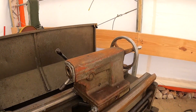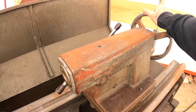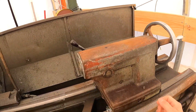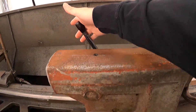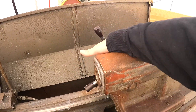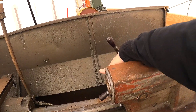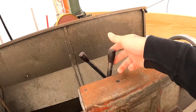One of the things that was wrong with this lathe when I got it is the tailstock. The tailstock moves, the brake works — you can stop it, slide it back and forth, no problems there. But when I go to unlock the quill, it stays locked. You can see here, like the brake, when I pull that, that pin moves right there — so it's obviously connected to the handle. And this must be the pin for the locking mechanism, and it doesn't move when I move the handle back and forth. I think it got stuck — rusted stuck — and somebody hit it with something, obviously. You can see from that little handle there — they broke the handle off.